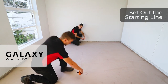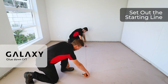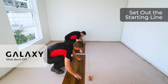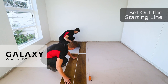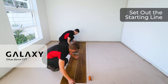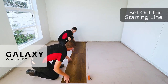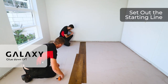I then get my colleague to help and we take a chalk line on the two center lines I've scribed, projecting our datum — shoot the chalk line until visible. We grab a box and set out, checking for any damages on the planks prior. A good installer always keeps an eye out for pattern repeats. We are using two lines to describe a straight line, as with one line your headers might open up slightly and you'll only notice after a few squares when it starts creeping out.